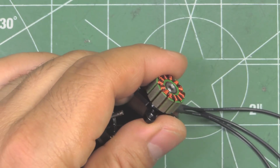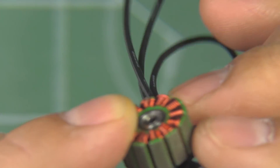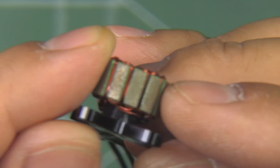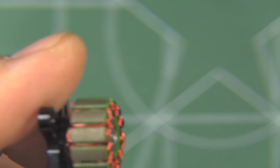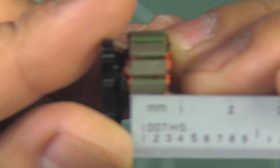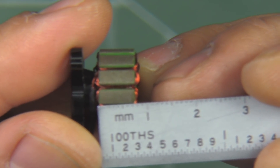Here's a close-up view of the motor taken apart. As you can see, very thin laminations - they certainly look like they could be 0.15 millimeter laminations, very very thin. Let's see what the stator height is - it's supposed to be seven millimeters. Getting a measurement there - yeah, it looks like a nominal seven millimeters.